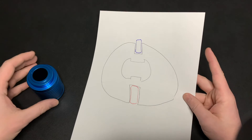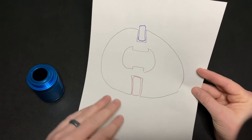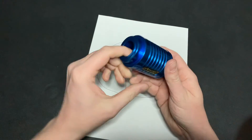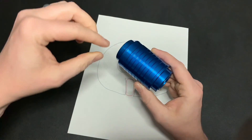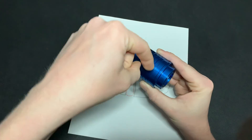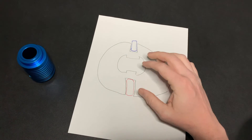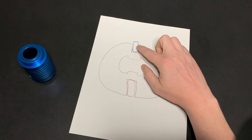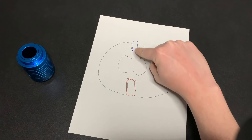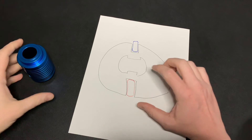I'll have a different video on cleaning. If you're having trouble getting the pin out — especially on copper where the pin's a slightly different diameter — one thing that works is taking a hairdryer. With the hole facing down, if you heat up the sleeve with a hairdryer, the sleeve thermally expands, the hole gets a little bigger, and the pin can drop through. I've done it myself and it does help. Also, the pins actually have different diameters — they step down about halfway through — which is part of why orientation matters.